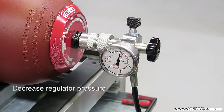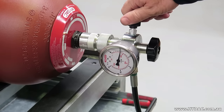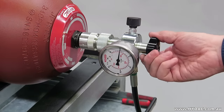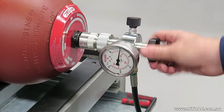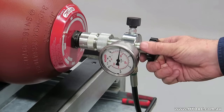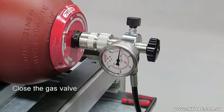Stop the flow of gas by backing off the nitrogen regulator fully. Small pressure changes may occur in the accumulator assembly with temperature changes. It is best practice to charge the vessel to a pressure slightly higher than what is needed, allow the vessel to cool, and then depressurize to the final setting slowly. Once the pressure is at the desired level, you can begin disconnection by winding the main spindle counterclockwise, then re-close the gas valve.